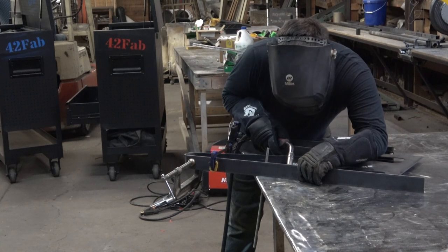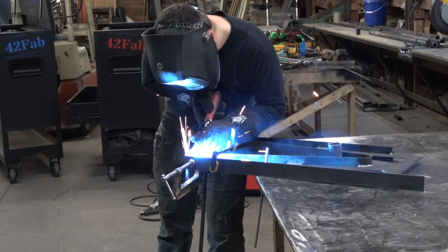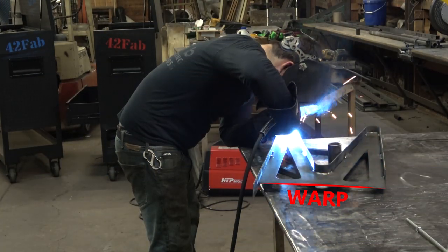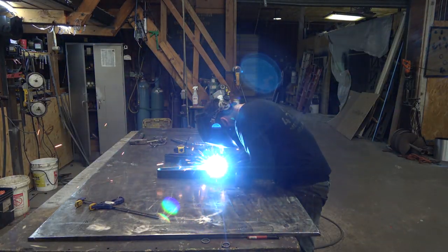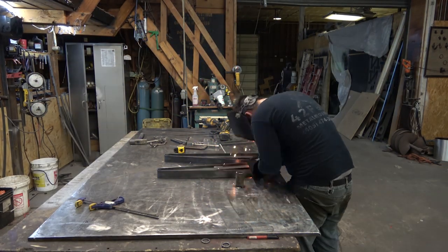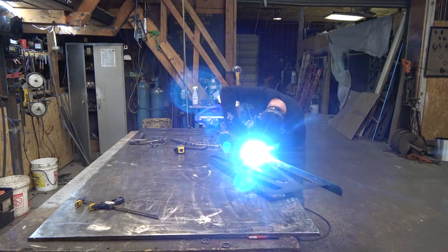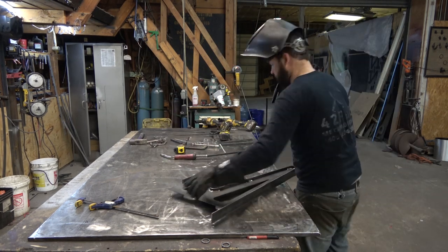As this was my first time tackling a project like this, one thing I didn't think about but really should have was that as I'm doing all these welds on one side of the plasma cut profile, I'm introducing a warp into that strapping. The weld cools and tightens and tries to pull the strapping out of 90 degrees. What I should have been doing is flipping the piece over and either alternating my welds or duplicating each weld on the other side immediately. The warp was pretty minor though, and in the end the entire thing sits flat within somewhere between a sixteenth and an eighth of an inch, which in a table base is not going to hurt you.